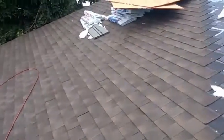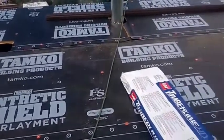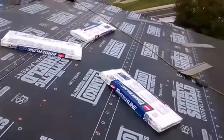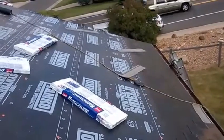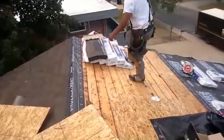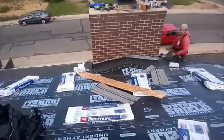We're in the middle of the re-roof. This is a synthetic felt. The darker color you see at the bottom — the black — is ice and water shield. Showing the re-deck; again, we have the synthetic felt.